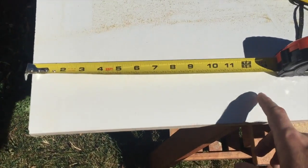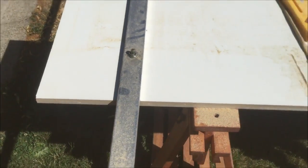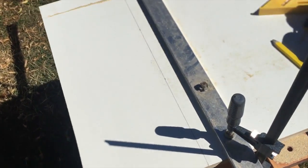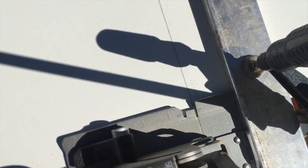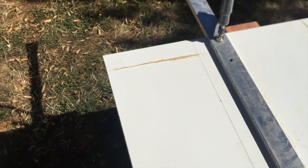For my cuts I mark nine inches, marking a few spots throughout the board at both ends. I take a piece of metal I know is straight, line it up with all the marks, and draw a line all the way across. Then I set it to the side, clamp it down tight with wood clamps on each end. The groove of the saw lines up with the line, so I can just put both hands on the saw and glide all the way down the railing - I know I'm not going to go off on either side. It's going to be perfect.